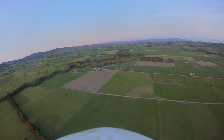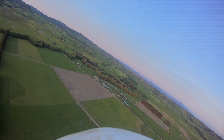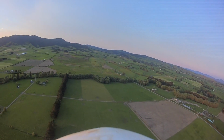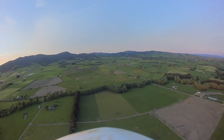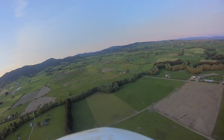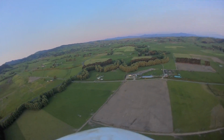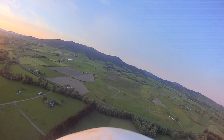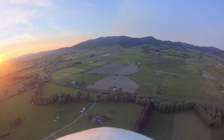Yeah. I really thought that would work nicely, but hands off. Looks like it could use a... I don't know, what are you supposed to do about that? If it's not feeling true gravity, how can you really... I mean, you could use the gyro only and just sense the gravity at the beginning of the flight and then ignore the accelerometer thereafter. But you'd have to really trust the gyro.